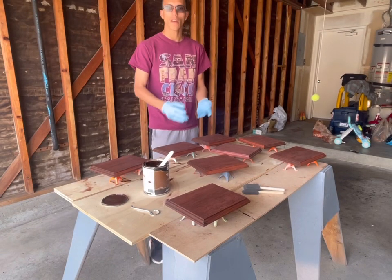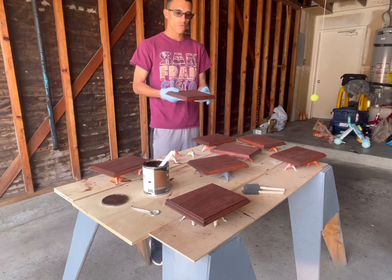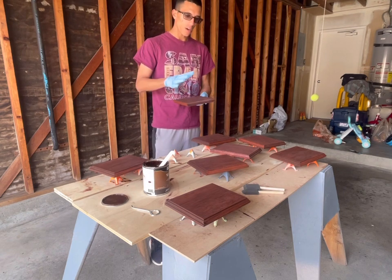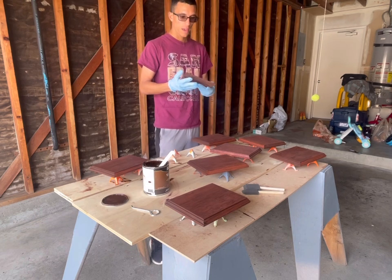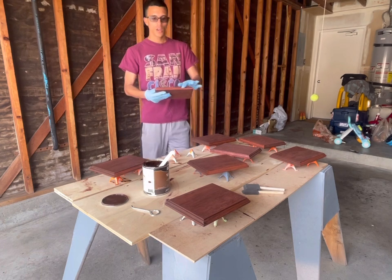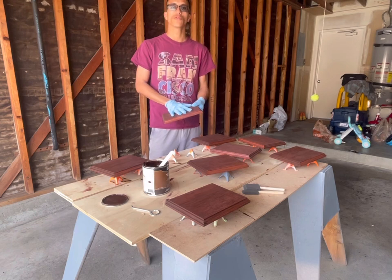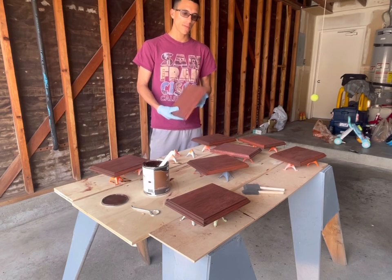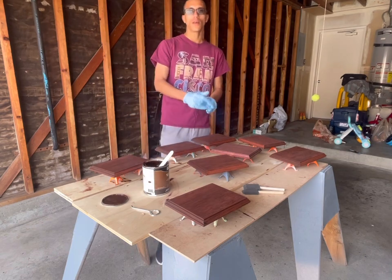It's been past 12 hours from when I previously stained it and it looks good — it's all rich in color. The back I don't need to stain one more time, I'll just leave it as is. The front I'm going to stain one more time. If you're okay with how it looks you can leave it as is, but I wanted a little more richer look and darker tone, so I'm going to coat it one more time — just the front and the edges.